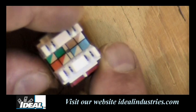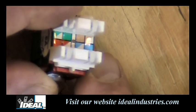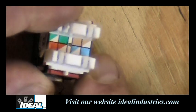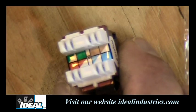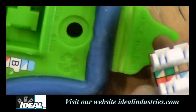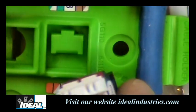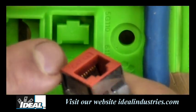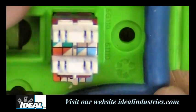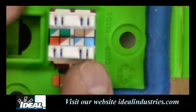Normally when you're terminating a connector you might be sitting on a bucket or working underneath, so connectors can roll and you can damage the wall or the connector itself. Many manufacturers, including Leviton, make what are called termination pucks — an aid to keep the jack stable so it doesn't move when you terminate it. The connector and termination puck have corresponding halves, and the connector loads right into the puck, giving a nice solid surface to work from.